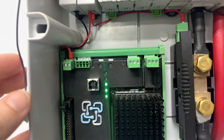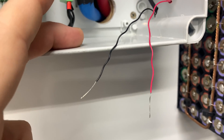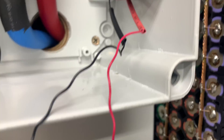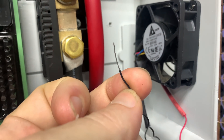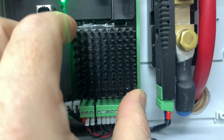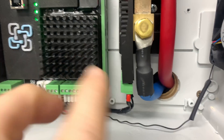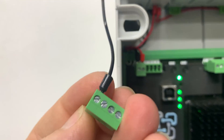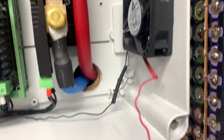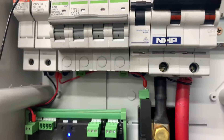OA is the shunt trip, and OB will be for the fans. The fans themselves aren't finished yet. I've got the two cables there — the negative and positive going down. I've already got the heat shrink on there. These are 12-volt fans but I'm running a 24-volt system, so I'm going to wire them in series: the negative of one fan goes to the positive of the next fan on top. I've done some test fits, and I've already taken the paint off the heat sink, but that won't matter once the fan is on top. Then I'll run the negative around and into there, and run the positive up to positive here — because that will make it fused. That is how I plan on doing that.